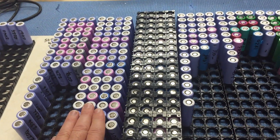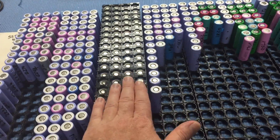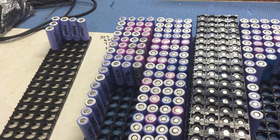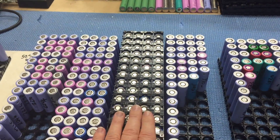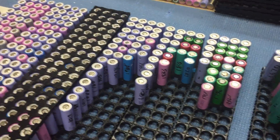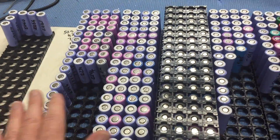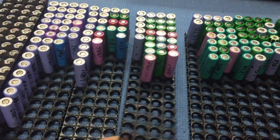So basically the way this pack is now being built — and I hope this is the last time I change my mind, but I still reserve that right of course — do 80-cell packs and then as I get more and more of the higher capacity, the lower capacities will drop off and be replaced. I know the battery packs won't be balanced. I know this one's going to be higher and this one's going to be lower, but the plan is to just keep bumping the lower ones off until I've got a rough average of 2000 milliamps and above. I could throw all these in and it would probably work if I balanced all the packs, but I want to keep a constant supply moving — if I do 80-cell packs I can just remove an entire 80-cell pack and replace it with a bigger one as I can.